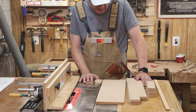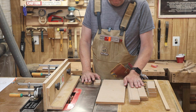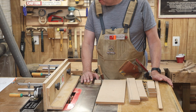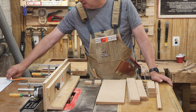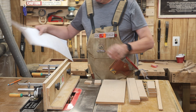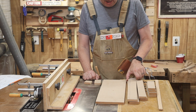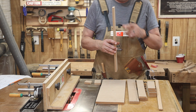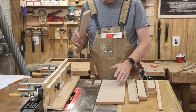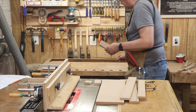All pieces are finally cut to their final width and final length. According to my cut list and hand-drawn plan, I need eleven pieces — and that's exactly what I have. The last thing I have to do is cut rabbets along the edge and the bottom for the bottom part of the caddy, so I'll do that now and set these parts aside.